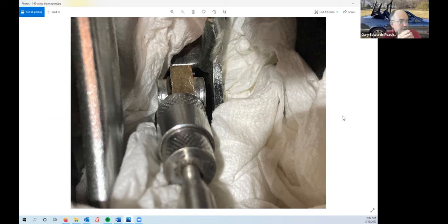The way I usually remove E-clips, wavy washers, and pins is with a very big magnet and usually a hook tool or sometimes a screwdriver. Most of the time, basically three things can happen when you remove an E-clip: it just comes out and it's in your hand — that's nice; it comes out and hooks on the magnet — also nice; or it comes out and goes pinging all over the place — not so nice. I try to avoid that. One way to avoid it is to put a rag over what you're doing, though it makes it a little hard to see.